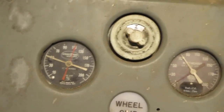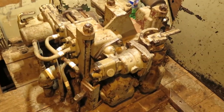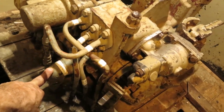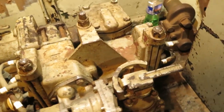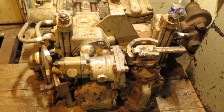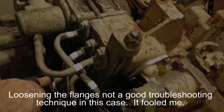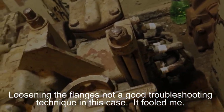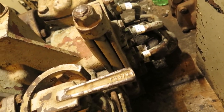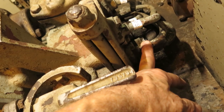Just to show you — that's the automatic brake valve, these are the gauges. The white needle on the left is equalizing reservoir; the white needle on the right is brake pipe. We'll make an application: the needle on the left goes down, the needle on the right — which is brake pipe — kind of stays where it is. We get a brake pipe reduction on this line coming from the automatic brake valve, but we don't get anything coming back out the other end, which is the outside of the N1A. I loosened these flanges where they connect and could get air here but not here, and unfortunately the flange gasket didn't like being loosened — now it leaks no matter how much I tighten it. We're going to have to take it apart.